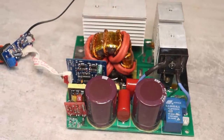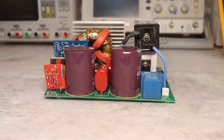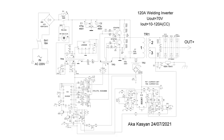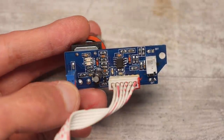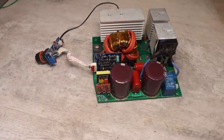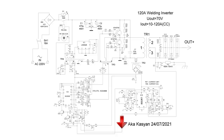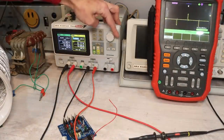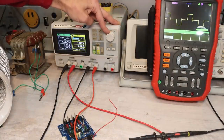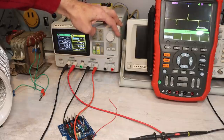The welding inverter itself is also equipped with a separate protection against short circuits, which is pretty good for budget inverters. The input current transformer is responsible for protection. The adjustment of the welding current is carried out according to the output, which certainly increases the accuracy of setting the output current. A shunt is used as a current sensor. Data from the shunt through the feedback line comes to the control board with PWM. It changes the duty cycle of the pulses by increasing or reducing the time the power transistors are in one of the two states. If the transistors are open less time, the output current is small, if more, large.